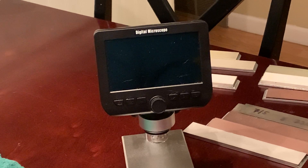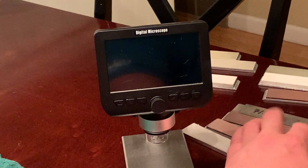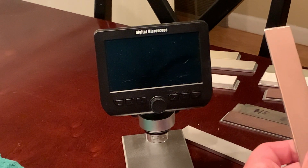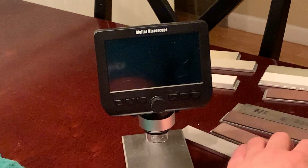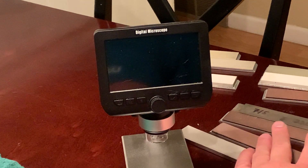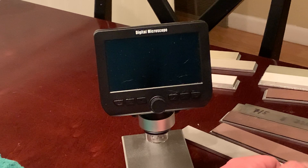Let's take a look at some of these under the microscope and see the difference in bonding. We can see how some of the bonding in these resins are rougher than others. The reason why resin bonded stones from Practical Sharpening, Gritomatic, and these Poltava stones can sometimes produce scratches is because of the bond — the abrasive is sitting in a rough, jagged bond. It's a hard stone, and when you have rough edges that stick up past the abrasive, you're going to get stray scratches occasionally.